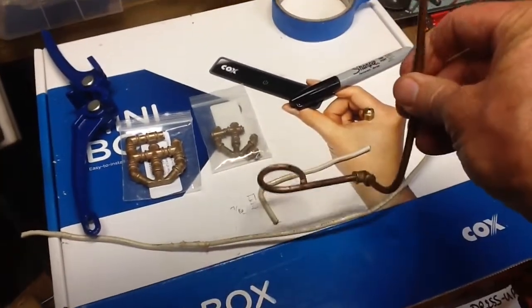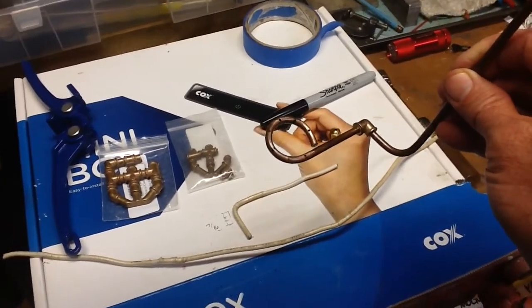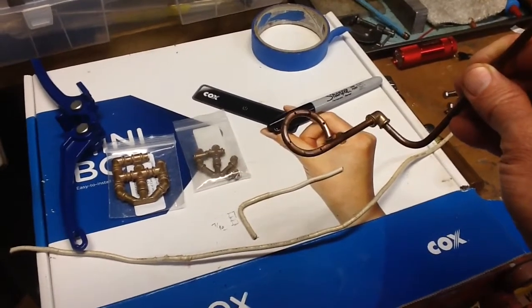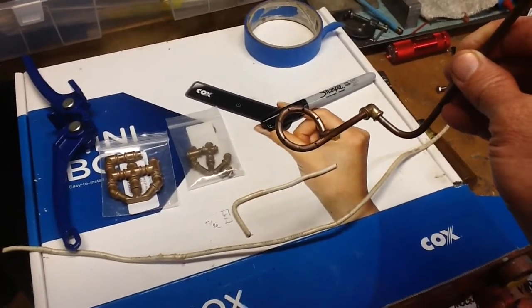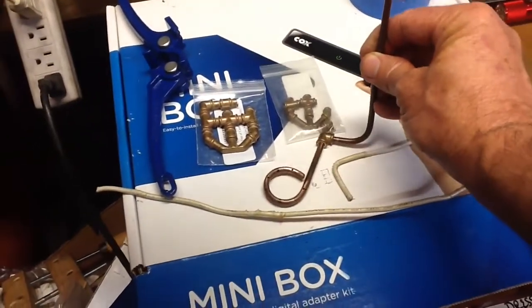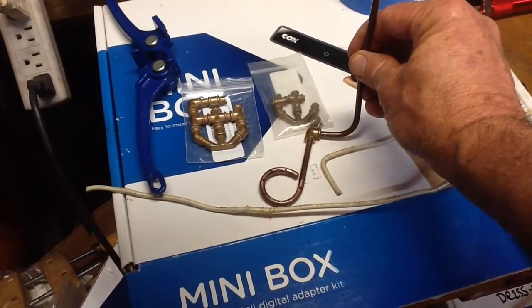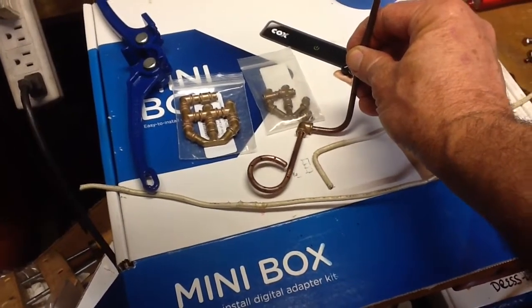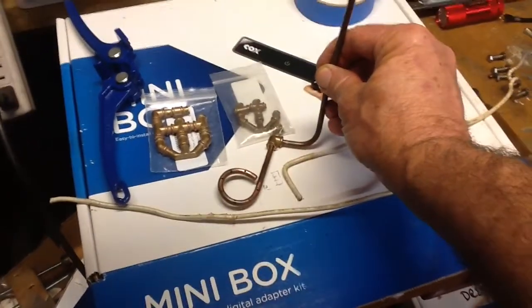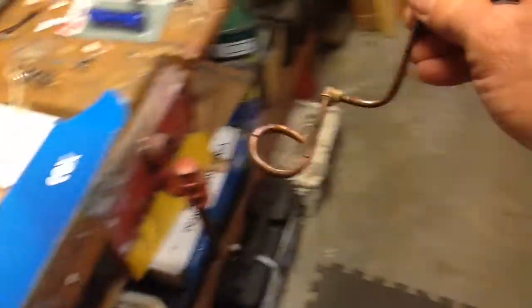I got to looking at the blower ring. Of course where we left off, I had just made the blower ring and silver soldered the little rivet in the end there, and I hadn't drilled the holes yet. I talked to John Shook who has built an Allen mogul, and John said to just make four 1/16-inch holes in the blower ring. So that's what I did — I hadn't drilled them yet so I got that done today.